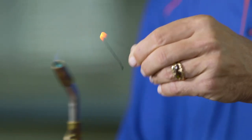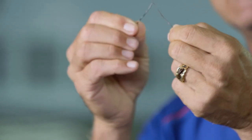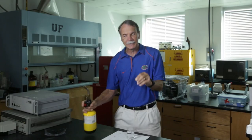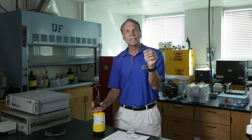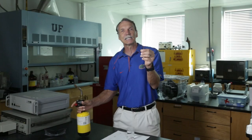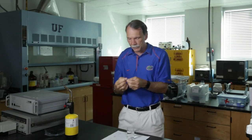If you take the same piece of steel and heat it up but slow-cool it, you no longer form martensite — you allow the carbon to go where it wants, and the material maintains its ductility. So quenching makes it very hard but brittle. What smiths would then do is a process called tempering: heat it up gently and let it slow-cool again. This retains some of the hardness but restores ductility — the material is no longer brittle. That ability to manipulate iron was critical to its development as a material.